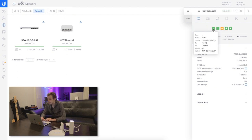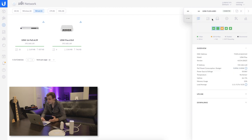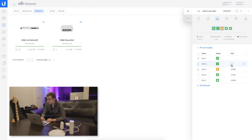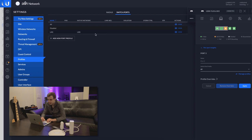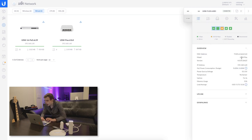We can see that the main uplink port is our main power import, and one port is running at 10/100 because it's simply just the little camera. We can see our other gigabit ports, and the port without PoE running to my laptop locally. This is a fully managed Ubiquiti switch, so we can come over here and change port settings such as tagging VLANs and adding in different profiles. This guy is just a managed PoE switch that happens to get its power from PoE, which is one of the coolest things ever. Nobody is making a product like this, and I am very happy with it.